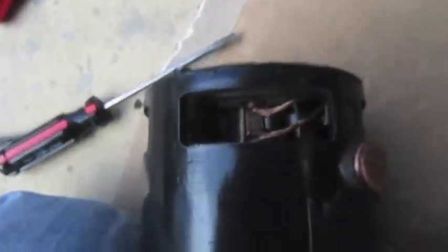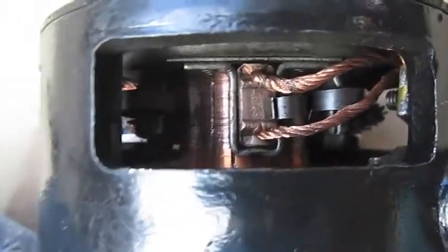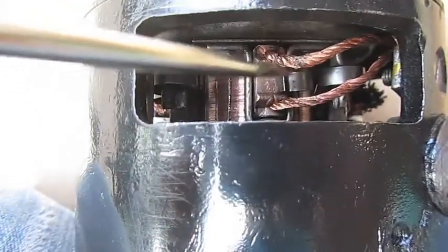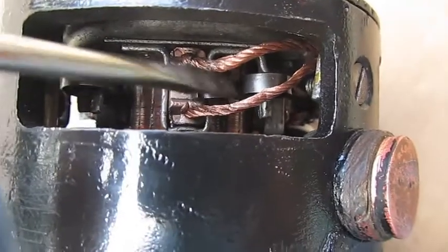Let me show you one of the shoes. Looking right down at one of these copper pieces that ride on the round rotating part — the commutator. There's a spring for each of the four shoes. You want to make sure the spring is centered in the middle of the brush or shoe, not to the left or right where it could pinch one of these copper strand wires. In general, don't yank or tug on these too hard.